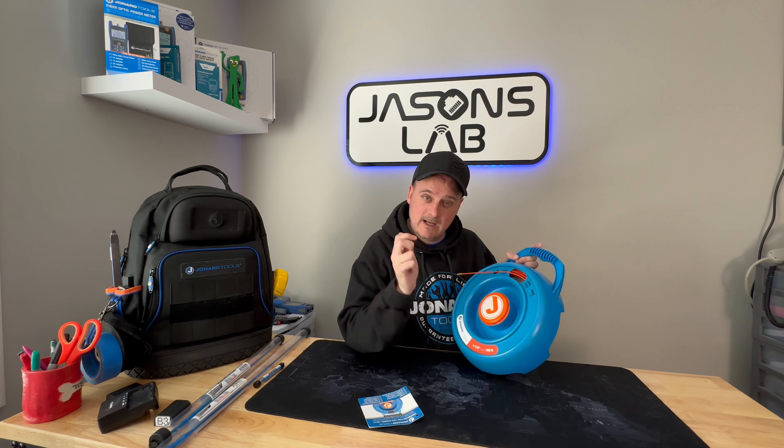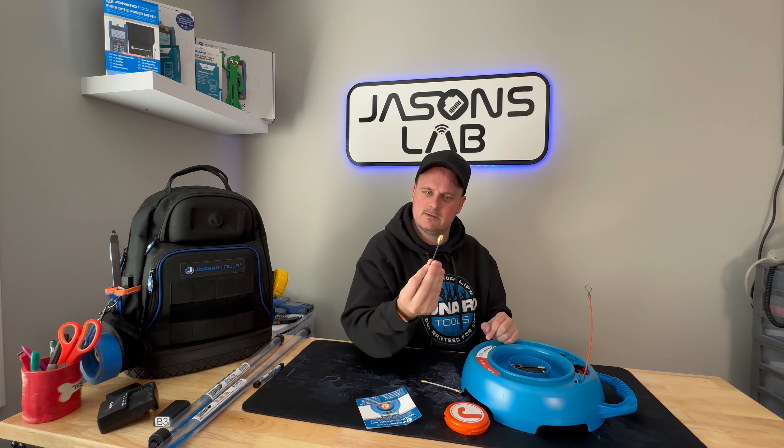Inside here we have this bit which is good for screwing onto the end. They're brass so they won't rust and won't get stuck. There's a loop on there that you just don't need to leave on for the future. This one would be handy — if you stick it in the wall you can tie something onto it and pull it all the way back. There's no sharp edge on it, it's actually round, so when you pull it back it'll follow where it came from. There's also other ends — this one looks like it'll bend so if you tie something on there it'll bend around some piping. There's also one that if you drop it down a wall or push it along something it'll go over things, because it's got a nice big ball on the end — kind of looks like a mini Easter egg.